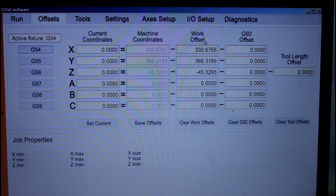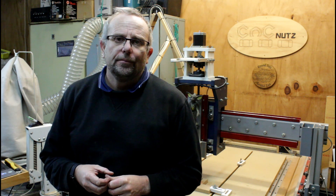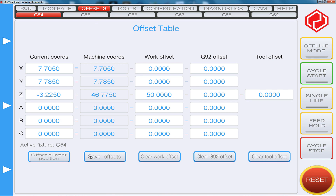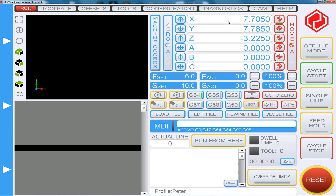Now if we have a power outage, I can quickly recover that position. If you happen to be using the standard screen set for UCCNC or Mach 3, that's no problem - there is a Save Offsets on both of them. Here we have the standard screen set for UCCNC. Up the top we have an Offsets tab - click on that and we're taken to the offsets table. Down here we have our Save Offsets; click it and our offsets are now saved. Back on the run screen, we can see our working coordinates, and on the left the machine coordinates button lets you watch the machining coordinates. On the right is the home all button - that homes the machine. You'll notice the Z-axis has a 50mm offset, but that makes absolutely no difference to this process.